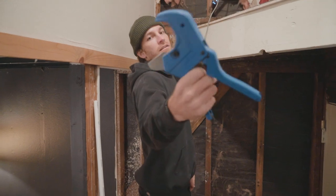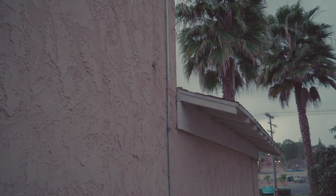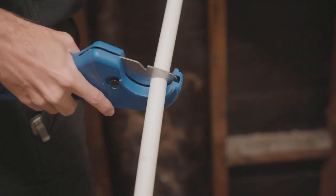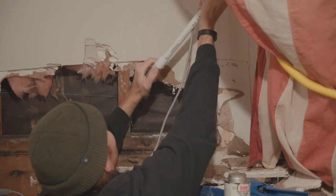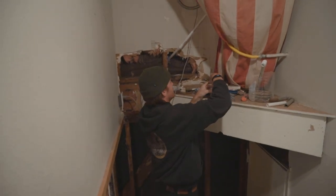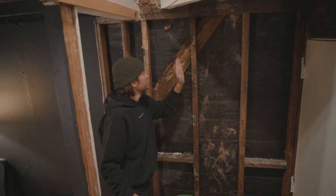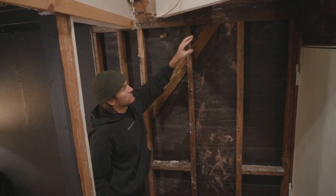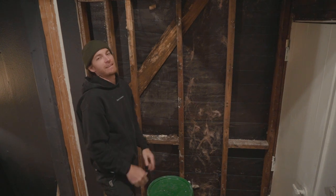Let's get serious. That's water — yep. It's a little long. There we go. Now it makes sense — water flows down. Down here we have to remove three studs — one, two, three — and then cut out that top plate, put a new one in there. Insulate. Drywall. Mud. Texture. Paint. Done. And then it'll match, and then we get to do this baby.